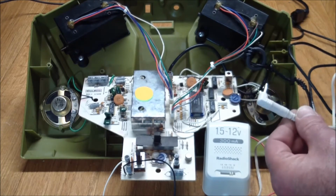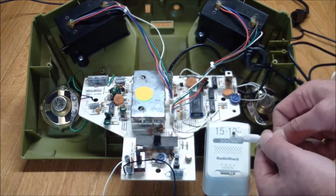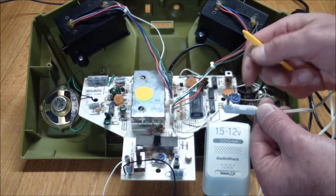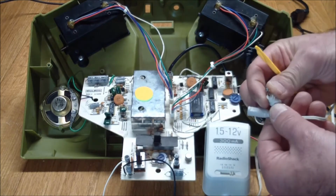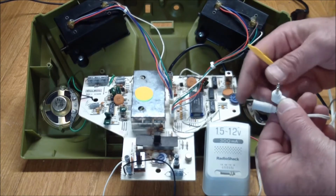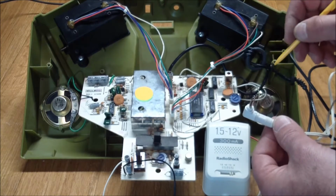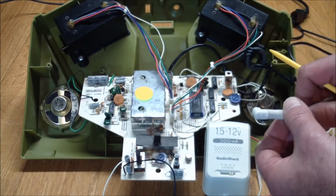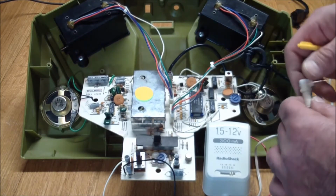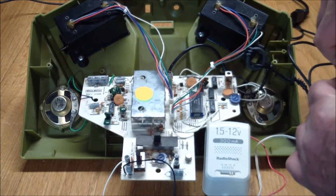And in order to get the polarity right, so this basically right here, probably impossible to see, but see, this comes off like this, and this is labeled tip, and this is labeled plus over here. So if I plug this in like this, and this is what this needs. It needs the tip to be positive. And if we look on the back, if we wanted the tip to be negative, we would just plug it in like this. But this is what we need.